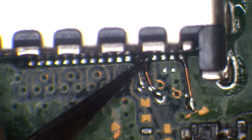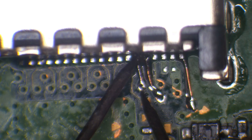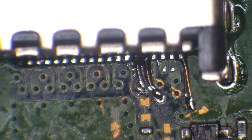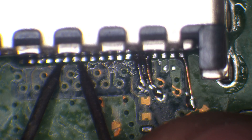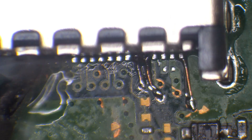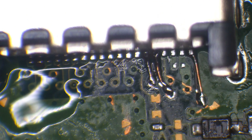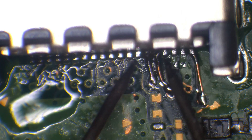I'll break away the excess wire and then check these wires to make sure they're all good. That one appears to be soldered to the pin properly and that one to the one next to it. I'm going to check for shorts to neighboring pins using the multimeter: continuity there, continuity there, no continuity there, no continuity there, no continuity there. Good. Then I check for bridges — and there is a bridge between pin three and four. That would have shorted out data lines two and three. That's why I always check with the multimeter.